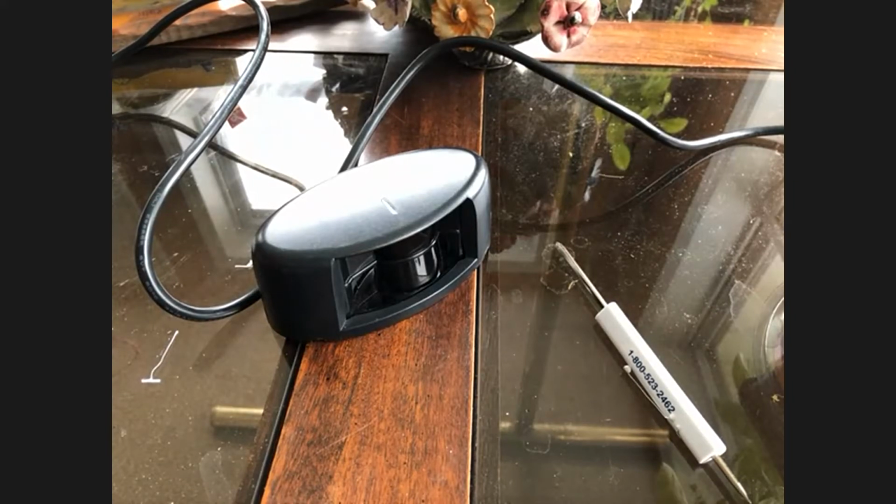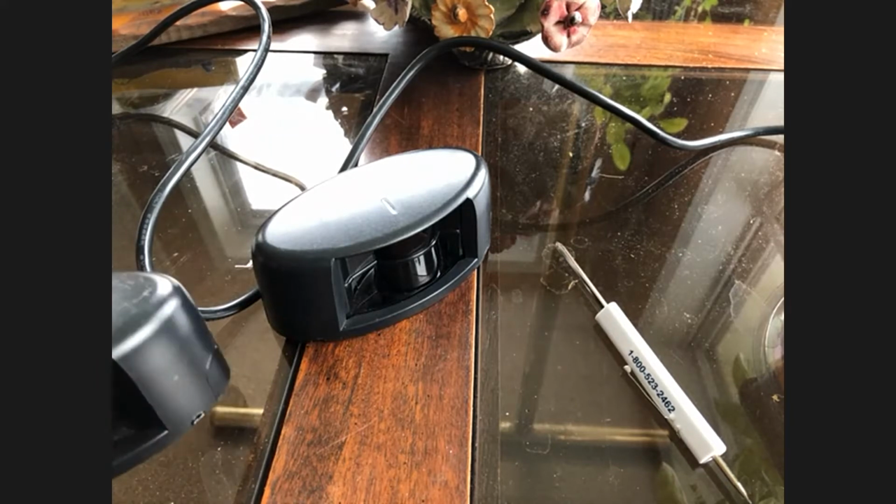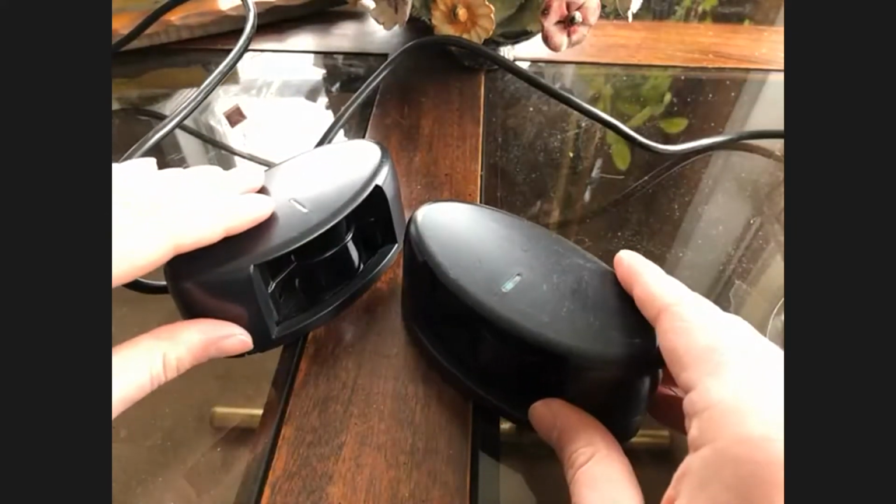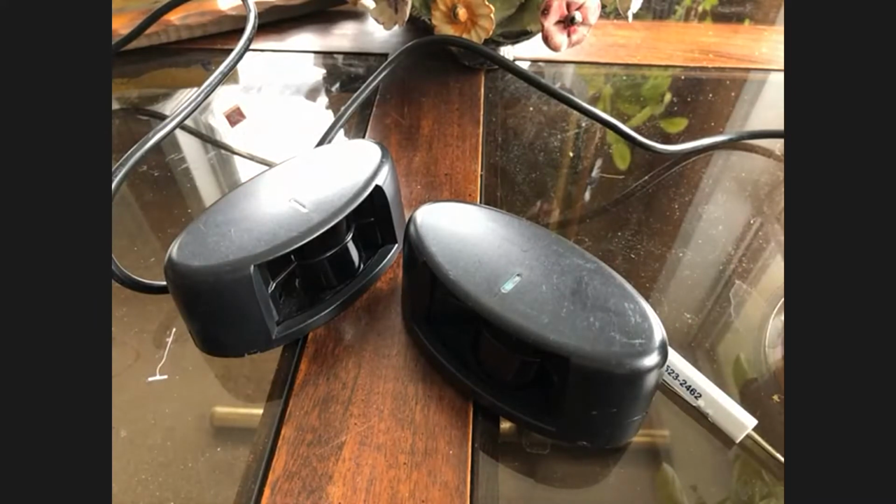So Rob, what would you say the most common MicroScan call is? From the calls that I see, it's usually a door holding open or door holding closed. It depends on when, because on brand new installs, I see a lot of misunderstanding of the home switch. The home switch is also on the hub, and it gives you the orange LED when the door is closed, because it's on the orange wires on the system's harness. It will not do a learn. It will not conduct a teach-in at all if your home switch is not closed when your door is closed. So that's probably the most common on an install.